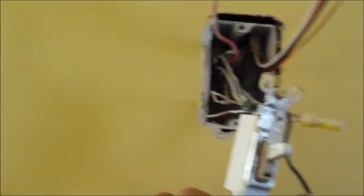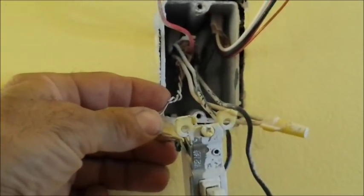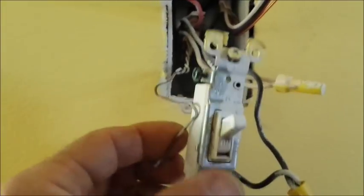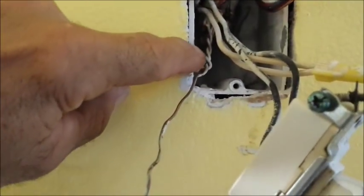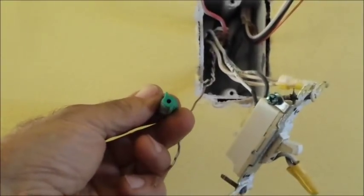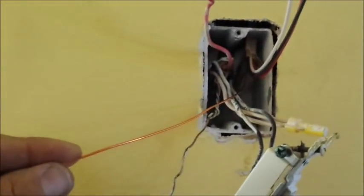Another thing I want you to look at here is the ground wire — we need to group our ground wire with this group of ground wires. Now this house was wired at a time when a ground wrap or twist of wires did not require a wire nut. They have since found that it's a good idea to get a wire nut on those because they can work loose — you can see this one is even starting to work loose. So what we're going to do is remove that and straighten this out. We're going to wrap our ground wire around this twist and use one of these special wire nuts made for a ground wire grouping. We're not going to put it on just yet because we need to add our ground wire into that twist of wires.